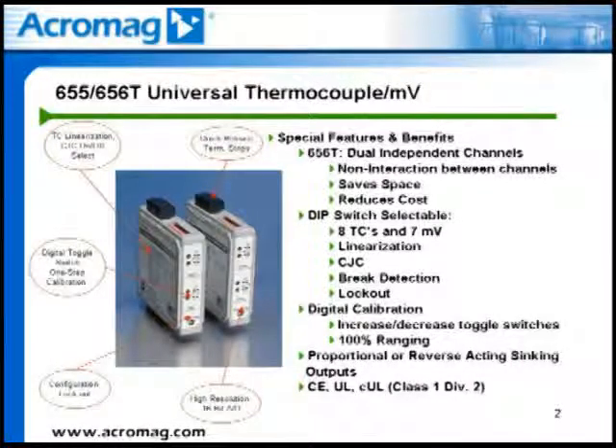The small DIN rail footprint and the air holes in the enclosure give the ability to mount these modules right next to each other, ensuring minimal panel space, helping to reduce panel size and installation time, thereby reducing costs. This also aids in smaller on-site enclosure installation where mounting space is at a premium. Additionally, unused channels fill spare channel requirements and can be used at a later date.